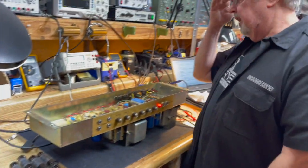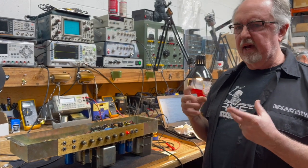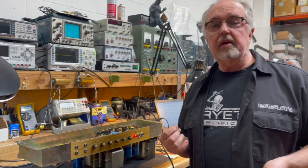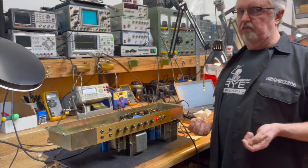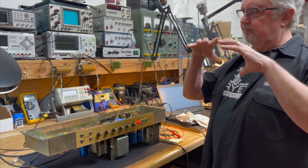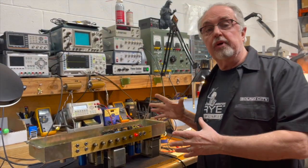In the late 80s, the Sylvania 6CA7s had a problem with mechanical rattling. You could hear them rattle and click around in there. And so they started to develop a bad reputation. But by this time, GE had already stopped making 6CA7s. So they were actually buying EL34s from East Germany and branding them GE. RCA was doing the same thing. So the whole concept of which tube is which and how they behave got really blurred by the actions of these different companies that were gradually phasing out their production anyway.